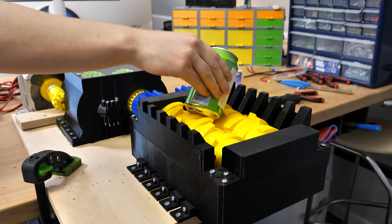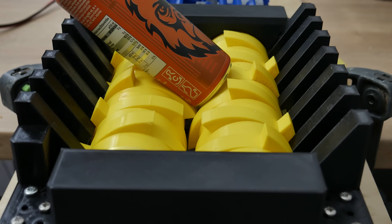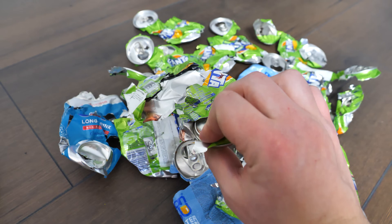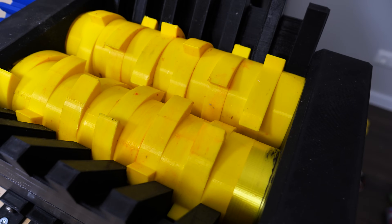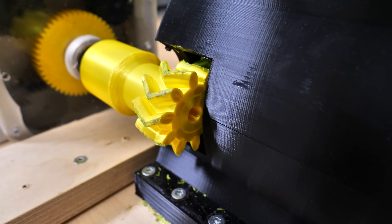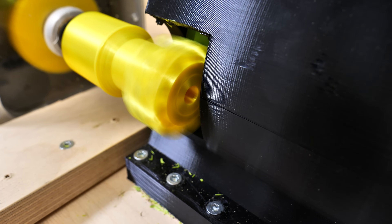As we just saw, the shredder is now a real shredder — not just a salad chopper. I successfully shredded 20 aluminium cans. In the last video the shredder could barely manage something like this, but this time my first, second, third, and fourth attempts all went through after redesigning, reslicing, reprinting multiple times, and reassembling. After 20 cans, the shredder itself is completely fine and functional. The blades have some minor dents and scratches but are still in really good shape. The gearbox is also fine, except the input gear which has some wear — easily avoided with lubrication. I didn't use any because I record indoors and grease flying everywhere would ruin my room. Big thanks for watching, see you with a new project really soon. Bye!